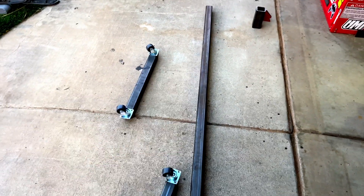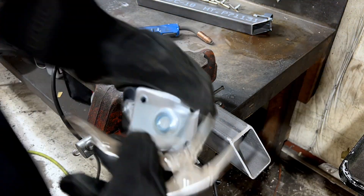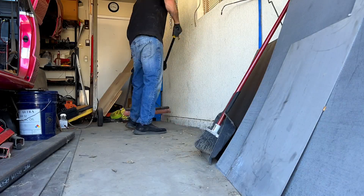Today I'm making a rolling cart that holds all these post tools. The design is simple — it's just going to be an eight-foot length section of two-by-two square tubing with heavy duty casters spaced about two feet wide, which is honestly not enough. It's kind of scary — I'm worried the thing's gonna fall over, but I need to take up less floor space so I don't want it to stick out away from the wall more than two feet.